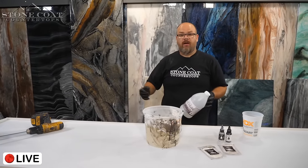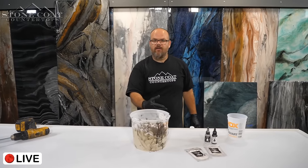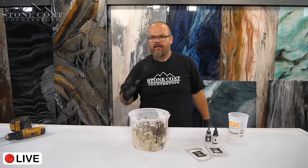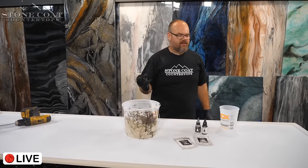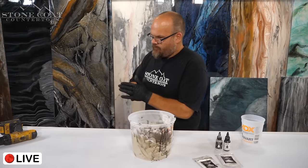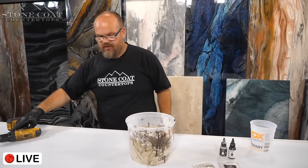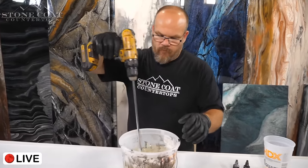And then you spray lacquer on cabinet doors, and you start getting voids all over it. And you're like, what is happening? It's because that stuff does not go away. So it's an excellent lubricator. It's a fantastic product for its own respective use. But if you're trying to get things to stick to something, I would not introduce it to the mix. There's other ways to get cells, and in this video, I'll show you how. Okay.